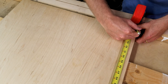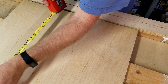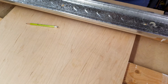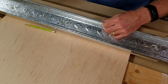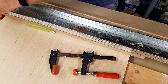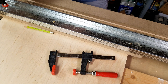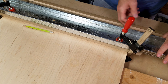I've got my tape measure set up and I'm going to mark 96 inches, which is how tall I need to make this. I make two lines, one on each side, then I walk the tape to the other side and measure out 96 right there. Then what I have is a poor man's track saw — just some MDF that was cut off. It's a trick I've learned for handling large bulky pieces of material. You simply line this piece up, which represents where the saw blade is going to go on my circular saw, line it up with these two edges, and clamp it down. Just make sure your support board is out of the way so you're not going to cut into your workbench.